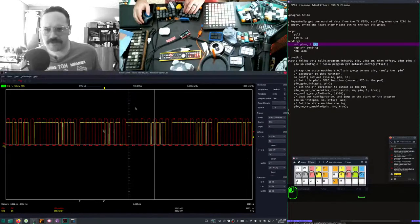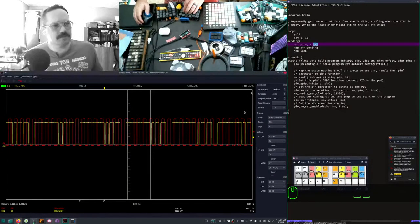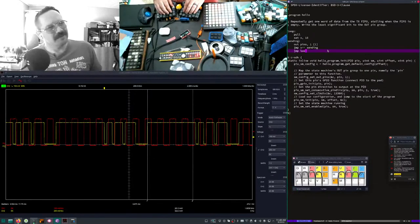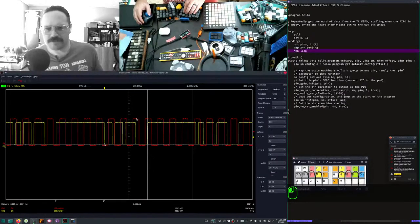Yeah. Do that. Measuring this length right here. 0.4. I keep looking at the wrong number. 0.02 milliseconds. Smaller. Much better. I think there's an extra clock cycle in there. Yeah, because we're losing the one. Actually, it doesn't matter right now. I just want to see if it scales up properly. That's 4 milliseconds, pretty much.